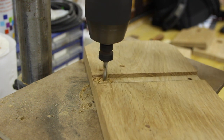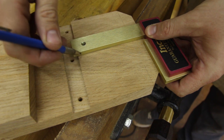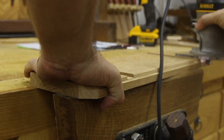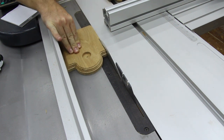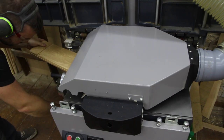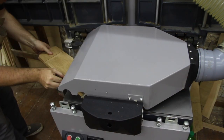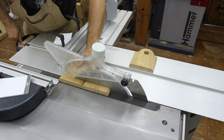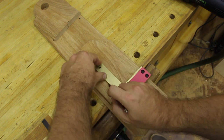This is an old drill press that we eventually upgraded. Now I'm measuring for the support of the bottom shelf of the paper holder — that's where the paper sits, and this is the back part. When I routed the edges to make them beautiful I found a problem: I couldn't continue the molding onto the sides. I had to mill those grooves I made with the curve maker all the way to zero, making the board thinner, but there was still enough material to work. Mistakes happen but you can always find a way through them.